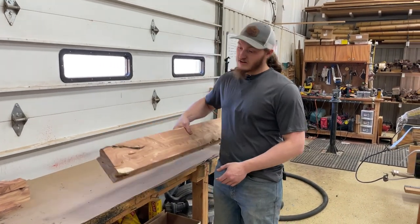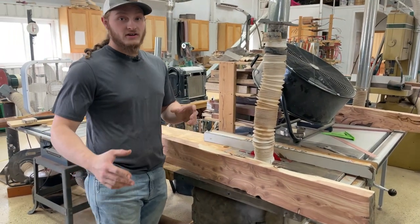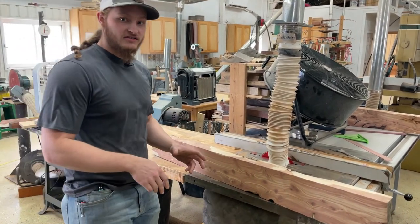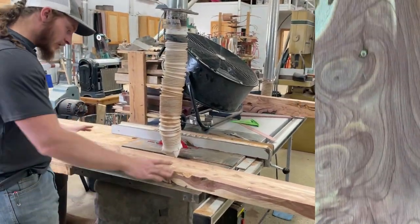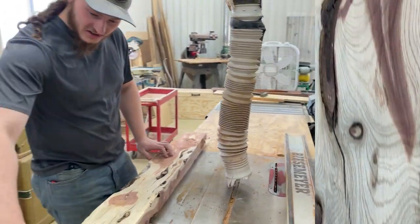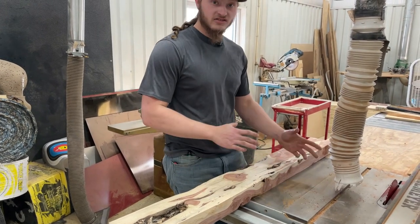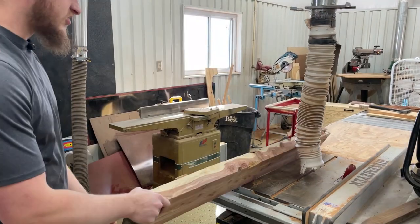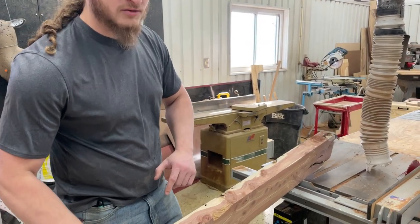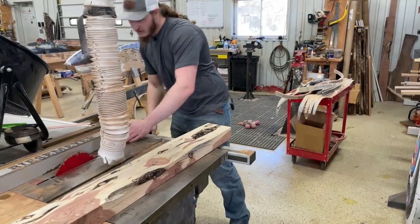Let's start with this block here and do our first fill. This actually came from a log — we split it out with a chainsaw into lumber, then ran it through the jointer until we had it squared up enough. You've got to look at your lumber and see where all those knots come through. You want as few as possible, but it's not going to be end of the world if you have them. We're going to take a good two-inch block off this side, which has white streaks and some curl in this cedar.